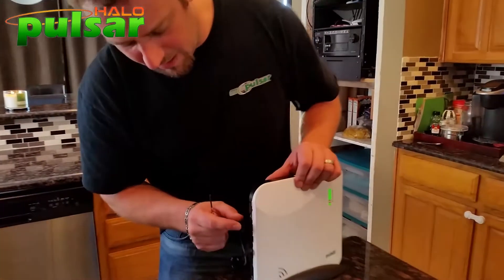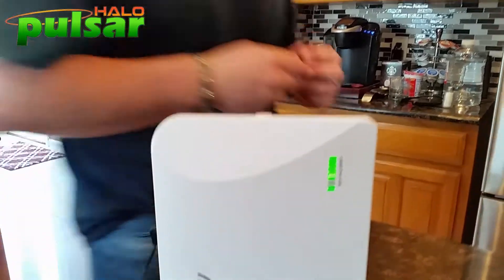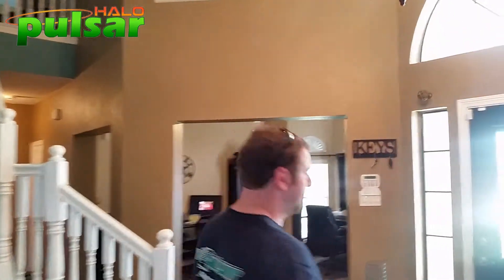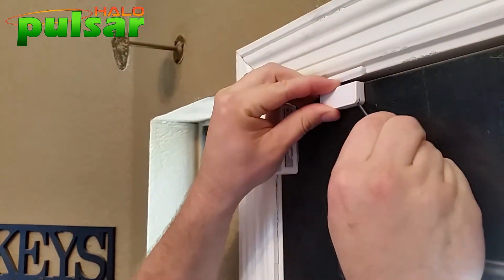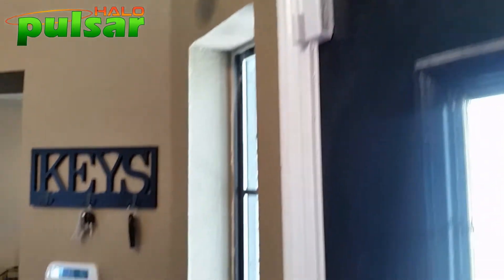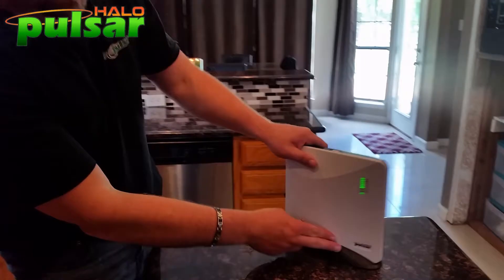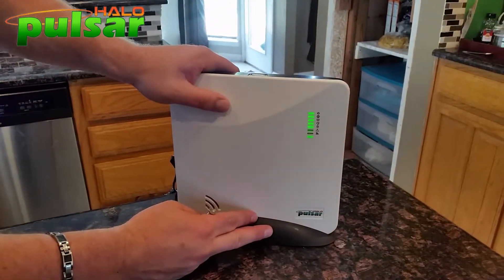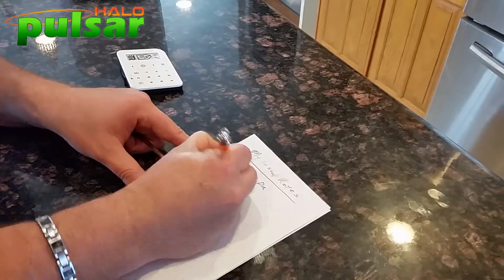It just accepted it, so now I have a working keypad with our hub. I have three doors and one motion detector from my old system that I want on this new system. I press the learn button again to go back into program mode — we're back to red. Zone one is my front door. Here's the little Nano max sensor on the front door. I stick the screwdriver in, lift it up, and I hear the beep on the hub. I close it back up, and in my install notes I write: zone one — front door.